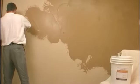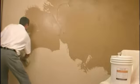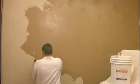Instead, the plaster will start getting gray marks as a result of your trowel scraping against the sand of the plaster. The easiest way to apply the second coat of Marmorino is in thin layers. This way you'll have more open time and have time to burnish the entire area. Also, layering will give you more variation, modeling, and texture if desired. As it becomes more compact and clay-like, you can add tighter and thinner strokes of plaster. This will give you more variation and sheen. Again, these are very tight, thin strokes applied with some more pressure.